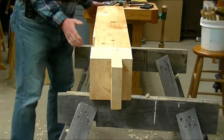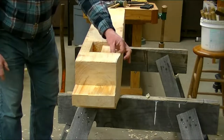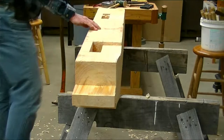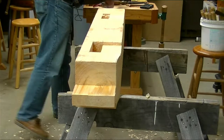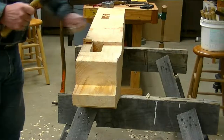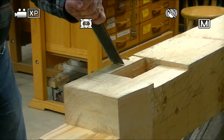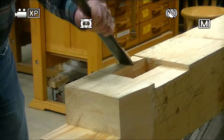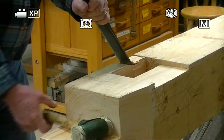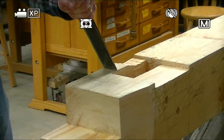The next thing I want to do is finish this right here. You can see how I've reduced this — I'm reducing it from eight to seven and a half. Somebody will say, why do you bother? Well, if you buy rough-cut wood, the wood is almost never exactly eight inches — could be a little more, could be a little less. So within an eight by eight, there is an ideal timber that is somewhat smaller. This has been laid out down to seven and a half inches.